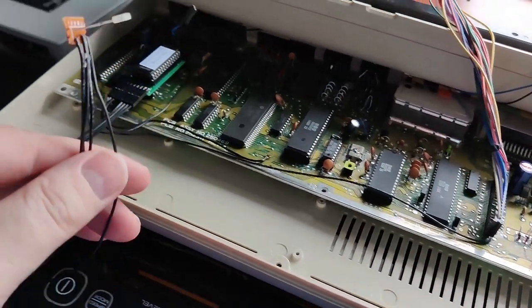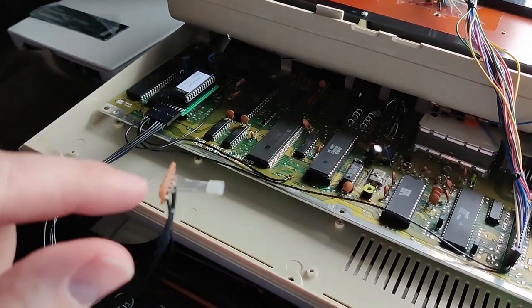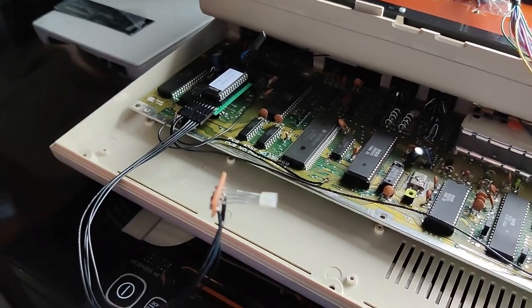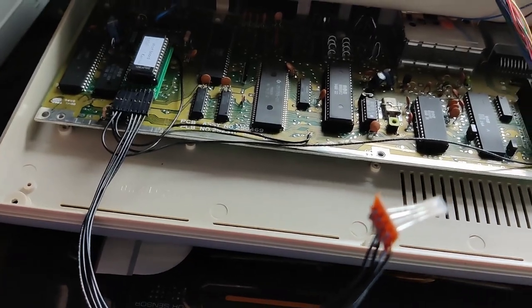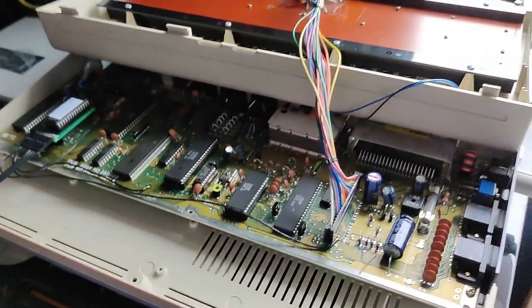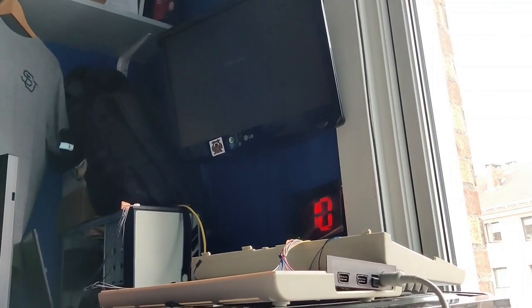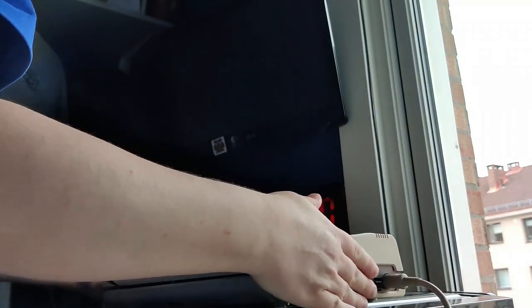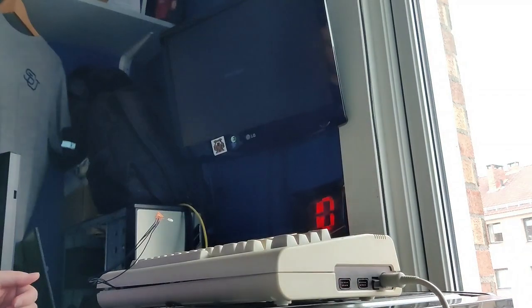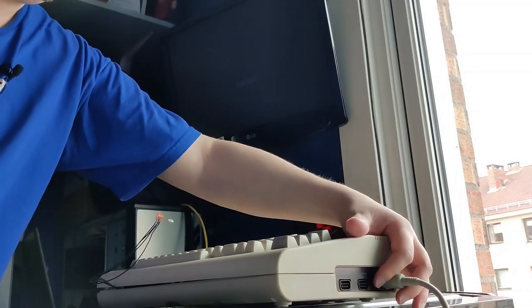But I figured out that I had something wrong with this one. So I think the cathode was in the wrong place. That means we had some overloading on the ATtiny. So now I fixed that and it's very stable. One problem people are reporting is that it doesn't cold boot actually. So let me try to film this. I'll put in the other chip, because when I experienced problems with that one, it was probably just this LED. So let's see if it cold boots.